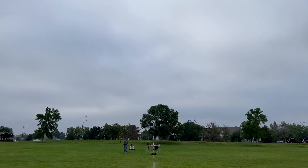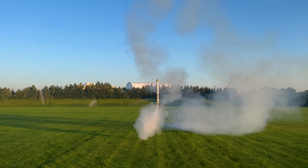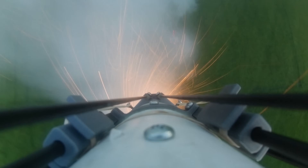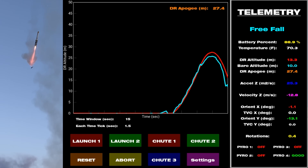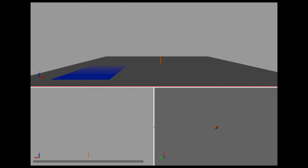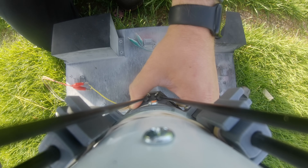How does it land? While watching old flight footage I realized that TVC flight up is actually very close to TVC landing. The block of code required to have a rocket go up stable is actually the same required to come down stable. The trick is all about timing that second stage ignition. The rocket knows its altitude by integrating the adjusted vertical acceleration twice. I decided to do it this way because my flight computer didn't have a GPS unit and I didn't trust the noise in the barometer enough to include it in the calculations. To find the landing burn altitude I altered my offline simulation to model landing dynamics and used that to estimate an appropriate burn altitude for the first flight.